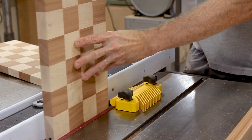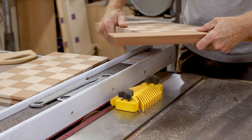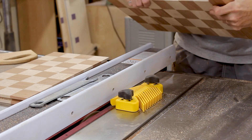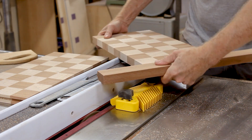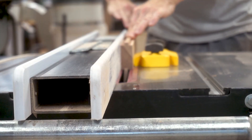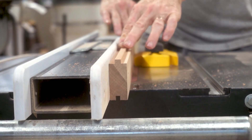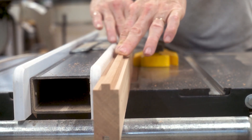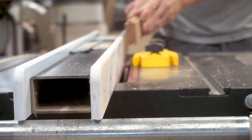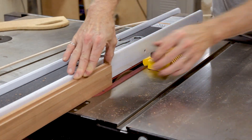The reason I'm not using plywood for this type of chessboard is because the middle will be exposed when it's separated, so I'm using solid wood all the way through. Next I'll cut a groove in the outside edge of the frame pieces, and this is to hold the edge banding. I flip the board around and make a second cut, and that ensures that the groove is always in the center of the board.